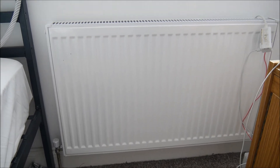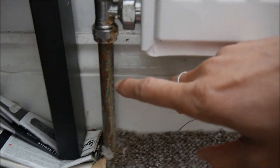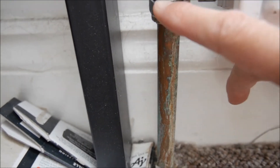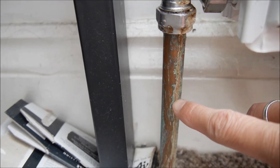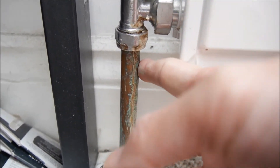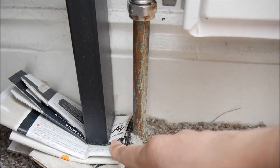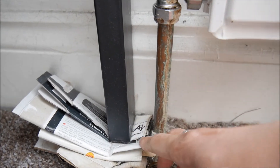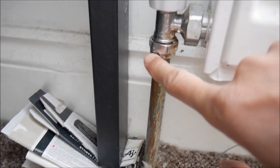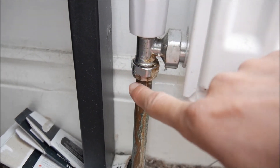I come up to the bedroom - this is a smaller radiator. You can notice that on the pipe here, you have to inspect it. There's some rust, and obviously this is because of water leaking, and also the copper pipe here is becoming a greener color. If I touch here regularly, I can feel and see some water is leaking. Today it's not too bad, but I also put some paper here - this is wet. You can see that this is not very good. I have to change it regularly because of this leaking. You have to check all the pipes in your house, the radiators, the in and out, whether leaking or not.